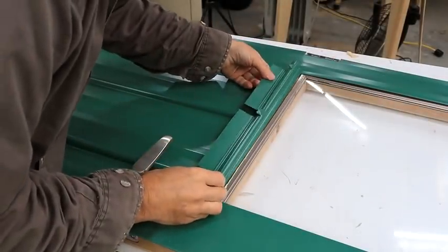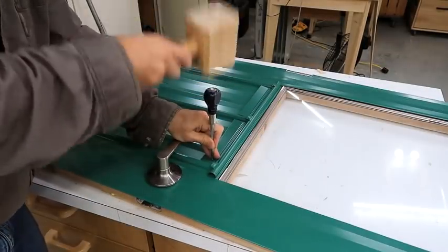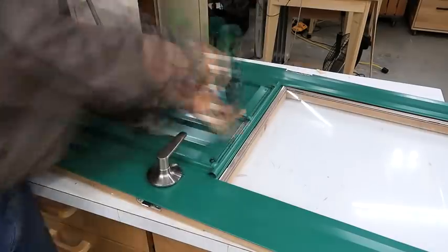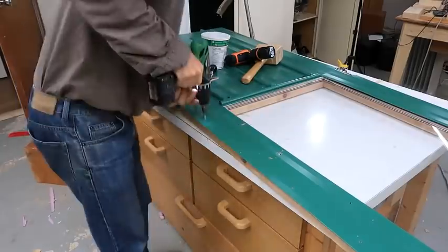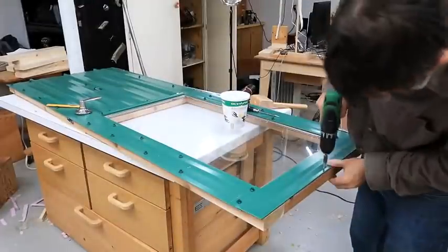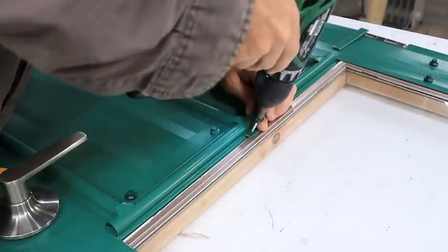This complicated piece fits under the window and it's designed to deflect water that runs down the window over the corrugations on the front of the door. I need a whole lot of screws along the edge because the flange overhangs, and when the door closes it slams against that flange, with one extra little tab to hold in the bottom edge of the window.